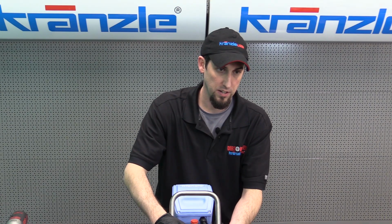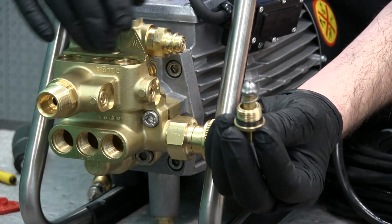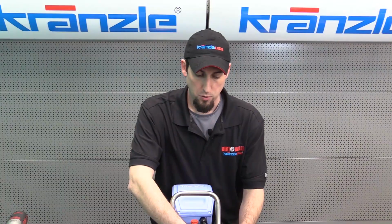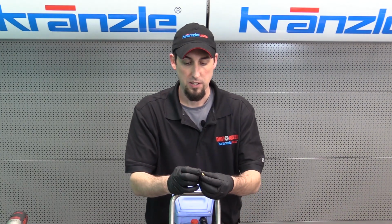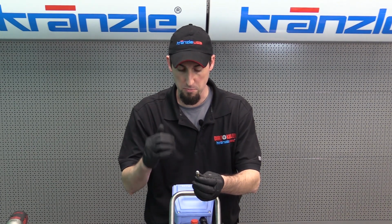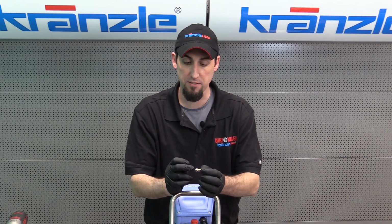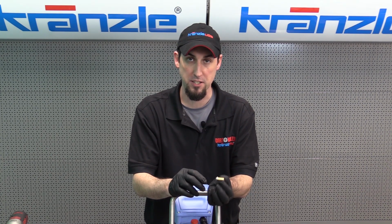There is your easy start valve. There you'll see your easy start valve inside the cap. So while we're here, the easy start valve permits a little bit of flow at the very beginning moment of the motor starting. So inside of this plunger is another ball bearing and spring.